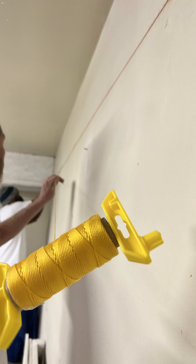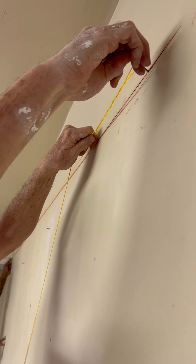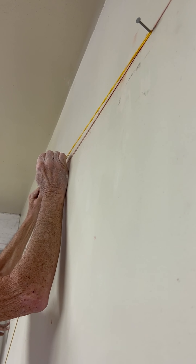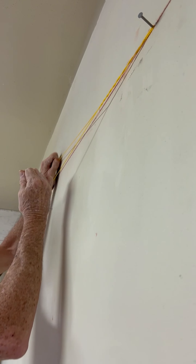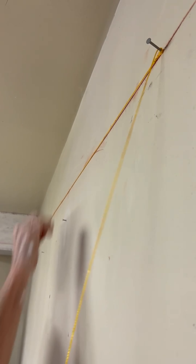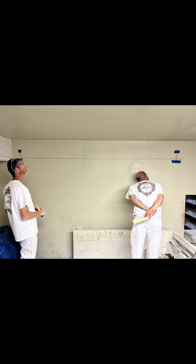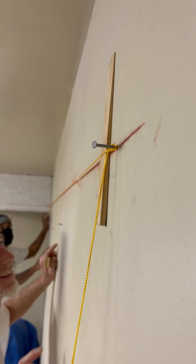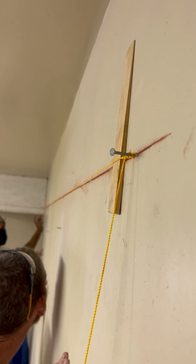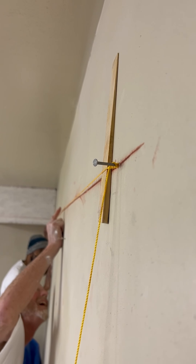Dry-line the walls. With a nylon line, check how straight your wall is at the bottom of the crown. In the event of a negative, shim to the line. In the event of a positive obstacle, bring the lines forward at both ends to accommodate and shim to the line. Leave the line on the walls. This wall had a positive obstacle, so we use shims at either end of the string to bring it flush with the obstacle.